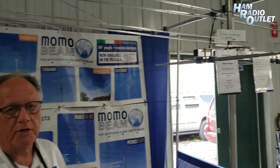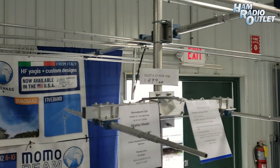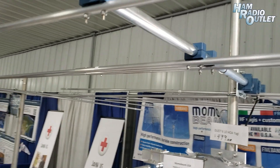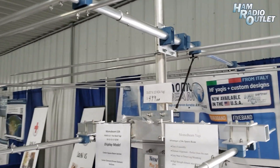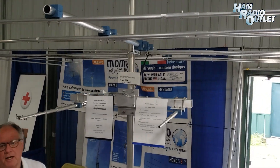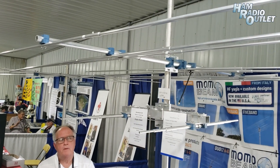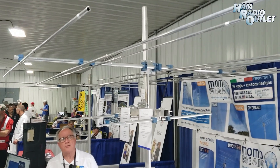Another interesting antenna that we brought to the market — this top antenna — is a six-meter and 10-meter Yagi. The whole concept of this one was to develop a solution for HOA-restricted people, to have a Yagi that can be in a very small diameter. This one translates to a ten-and-a-half-foot turning radius. It's three elements on ten and four elements on six meters. We use generally the same construction techniques as we do with the heavier-duty products that have been long standard with MammoBeam.